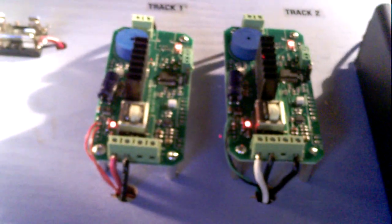Everybody talks about the need for circuit protection, especially for our sensitive RailSounds and PS2 engines. These little buggers accomplish all the protection you'll ever need. They have a transorb built in for spike protection, and they are also microprocessor-controlled circuit breakers, and they're programmable by jumper wire to the current output you want.